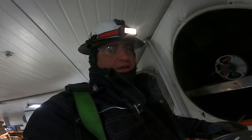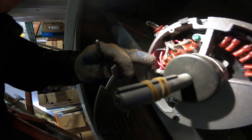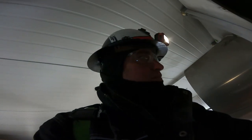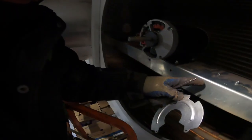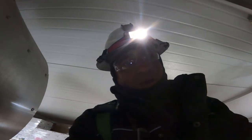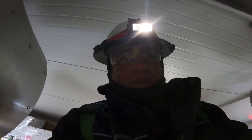We'll go ahead and bolt it up. Alright guys, I got it wired up. Lines 1, 2, and 3 are wired back up, with the voltage set on high, so we're pretty good. I've got to go ahead and put the fan blade back on and test it for rotation. For the grounding on this one, it's grounded through the rail via the feet — I went ahead and rubbed all the paint off with a screwdriver where all the feet mount. I'm going to check ground just to verify that I'm grounded to the motor.